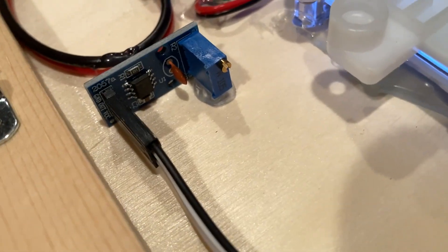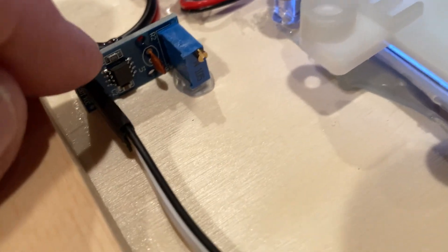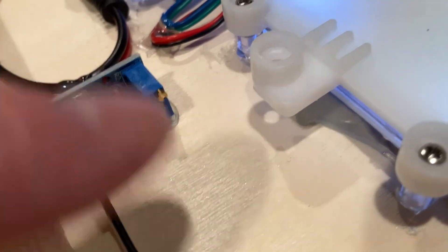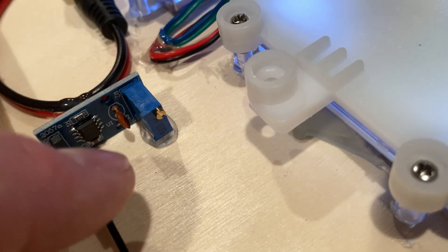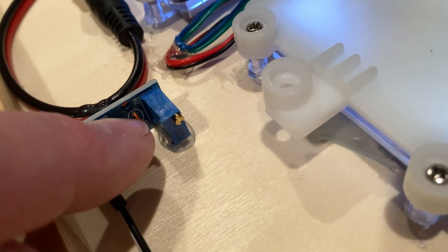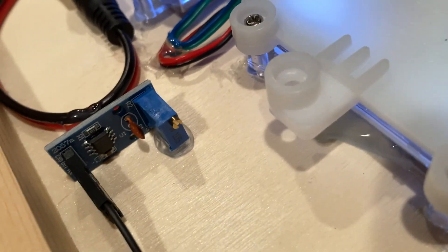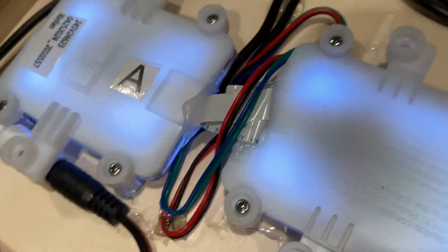Here's another shot of the pulse generator. There's the little 555 right there that does all the work, along with a couple of support components, your timing capacitor, your rate-adjustment potentiometer — a multi-turn pot. So that's about what makes her tick.